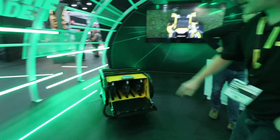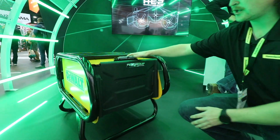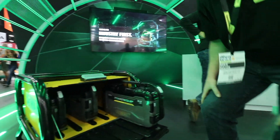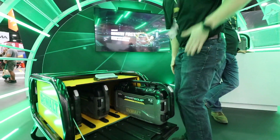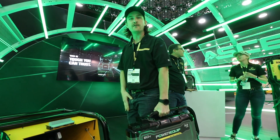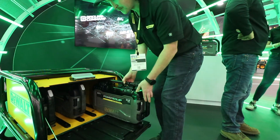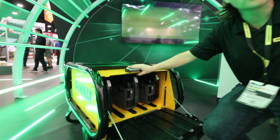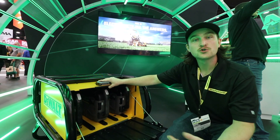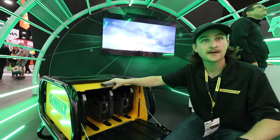Let's take a look inside the battery bay. From the rear of the machine, you open up the soft-close door, then click and release the battery. It's ergonomical — you slightly bend your knees and lift at the wrist. You don't need to lift the battery above your chin or shoulders, reducing shoulder fatigue throughout the day. You can run the machine with three batteries: one battery operates the drive, two batteries function the deck, and three, four, or five batteries give you additional run time.